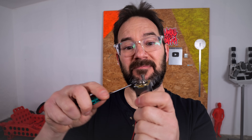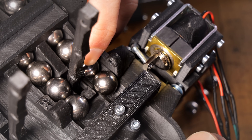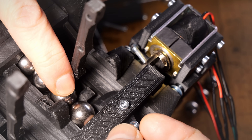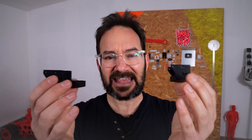The rows causing issues are the ones closest to the solenoids. The marbles stick together when they pass next to the solenoids and get temporarily magnetized. That only happens in the channel closest to the solenoids. I hope the solution is as easy as it seems — I made longer brackets that will put the solenoids farther from the marbles, far enough that they won't get magnetized. Now I just have to reassemble everything and see if this works.